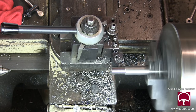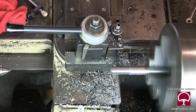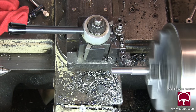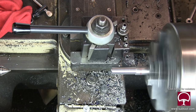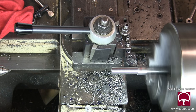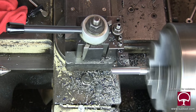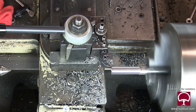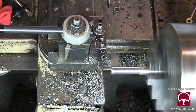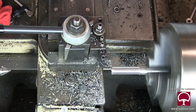You can't see what I'm doing behind the scenes here, but I have one of our sine plates with the ears on it, and I'm turning the diameter down. I'll take it out of the lathe and check it, make sure that it goes in the hole. When this thing is all done, that's really what's important. The concentricity is going to be very, very important.